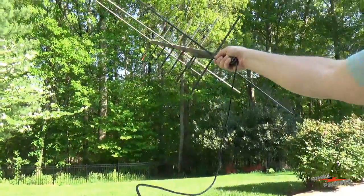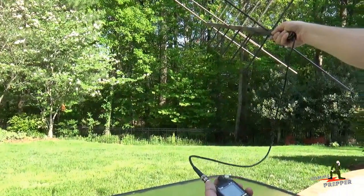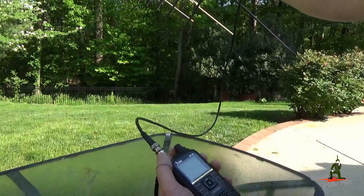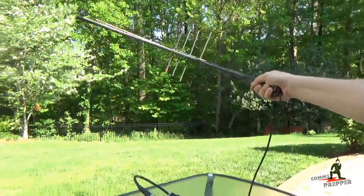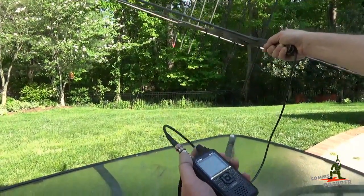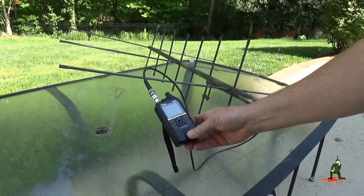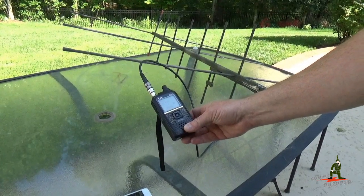As you're following that pass, you're increasing the channel on the handheld radio to accommodate for the Doppler effect. I'm going to insert two screenshots from the tracking software to give you an idea of what you'll be looking at, and then insert the recording of the QSO I had this weekend from the retreat location — using this handheld and this antenna from West Virginia, talking to a station in Maine with only 5 watts. Thank you for watching and subscribing. This has been the Comms Prepper with an introduction to working FM amateur radio satellites with your ICOM ID-51 Alpha handheld radio. Now we'll roll over to that recording — thanks for watching.